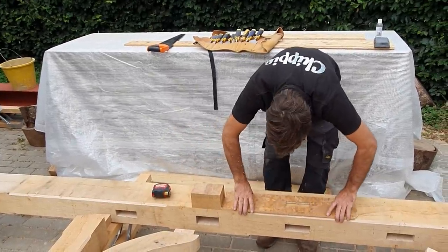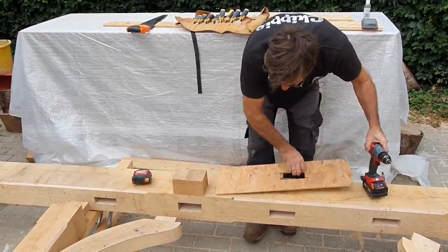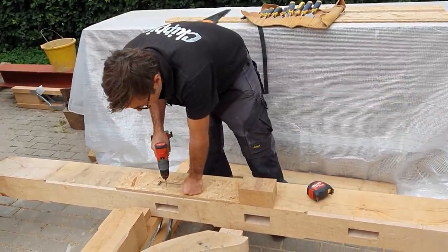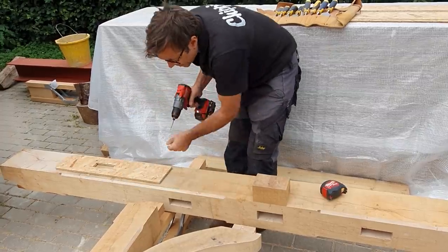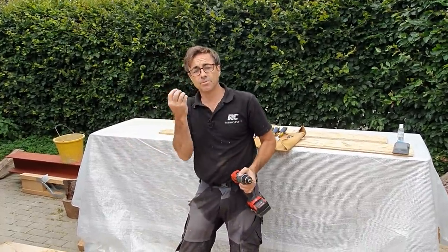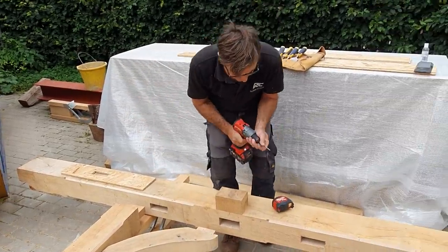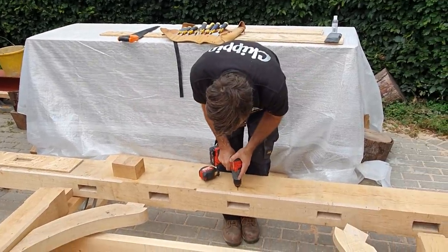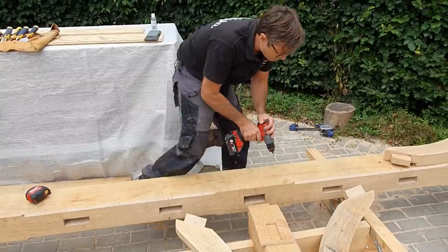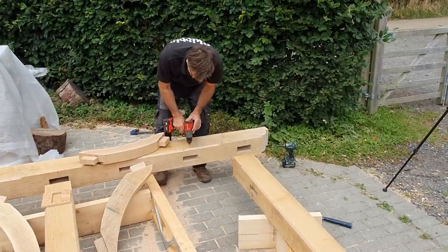Put that against there, pilot that one, flick it over and pilot the last one — it's great, there are no pencil marks. The other thing about using a small pilot like a 3 or 4mm pilot is that when I use the auger bit it's not going to drag itself through. Sometimes it can pull up the spoil and break out the top. By having the pilot in there all the way through down to the mortise, it's going to slow down the drill bit so it's only you pushing as opposed to the thing pulling its way free.